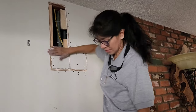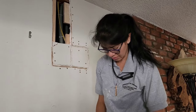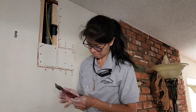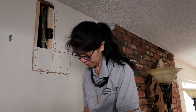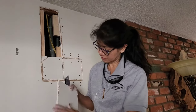The other thing she learned is that we had a contractor that did no sanding. Every patch he did, he only did patchwork, no drywall. He only did repair work, holes and stuff, and he never had to break out a sheet of sandpaper. When he's done, he either wet sands it a little bit with a special sponge, or he just trowels it to death until it's right where he wants it, and no sanding required. Normally, that's how she does it, no sanding.